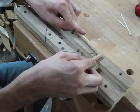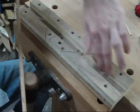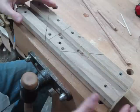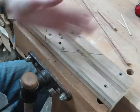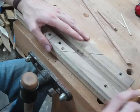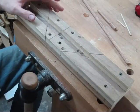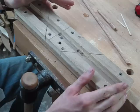You can make even a little picture frame out of something like that. You can cut molding in it just like a normal miter box — stick it up against the side and cut whatever angle you want. You can do compound miters, meaning rather than the standard 45 long ways, you can tilt your saw to 45 degrees and make a straight cut and have a compound miter. You can do any degree you want — 5 degrees, 31 and a third, 21 and a half, all that kind of stuff. Very, very simple to make, and you can make a couple of these and use them for different projects.